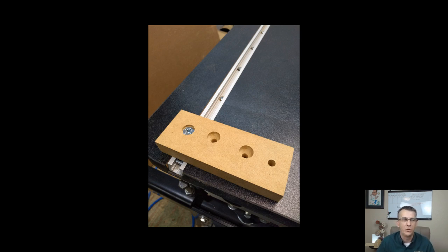And then I was able to go in, and I used a drill press. Now, you could use a countersink inside of a hand drill, and heck, you could put some blue tape around that countersink to create almost like a little visual depth stop, so when you get to a certain depth, you don't go any deeper. But I had 9 of these boards. I had 4 holes and 9 of these boards to drill, and I wanted the countersinks to be exactly the same. So I chucked up my countersink inside my drill press, and I set my depth stop so that when I come down, it's going to be the same depth each time.